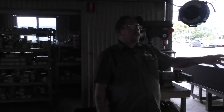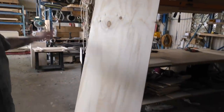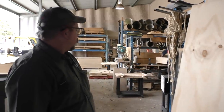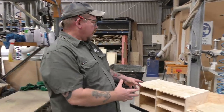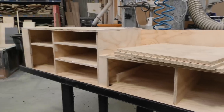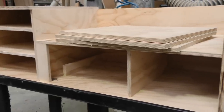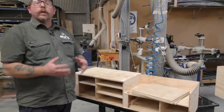The boys out here are working on some of the storage boxes and drawers that you've just seen inside. When the builder inside gets their order, they'll cut out the box on the saw, bring it out here and give it to the boys to put together, then send it inside for the finishing work. Same with the storage boxes. The kitchens are supplied to the builder as a raw product for them to do their work. As you can see here with this kitchen, the person building it has gone and cut their parts out on the saw. They'll come along now, fit all the parts onto this kitchen, get it all fitted with the gaps nice and even, then laminate it, sand it all up, and get it ready for the spray booth.